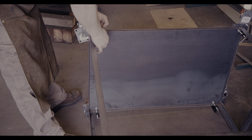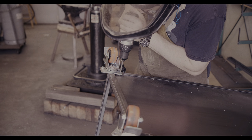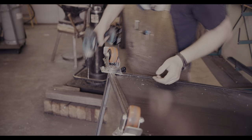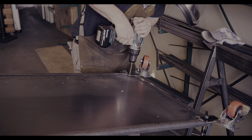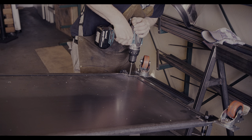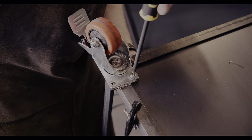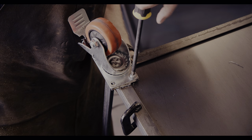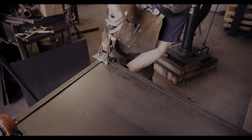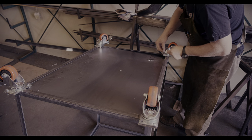I am cutting the piece and will just reuse the holes from the rollers to attach it. This time using a handheld drill rather than my drill press. You can see how much longer it takes to drill these holes even though the sheet metal is quite thin in comparison. To attach the sheet metal against the plate for the rollers, I am inserting a couple of spacers to fill up the gap.